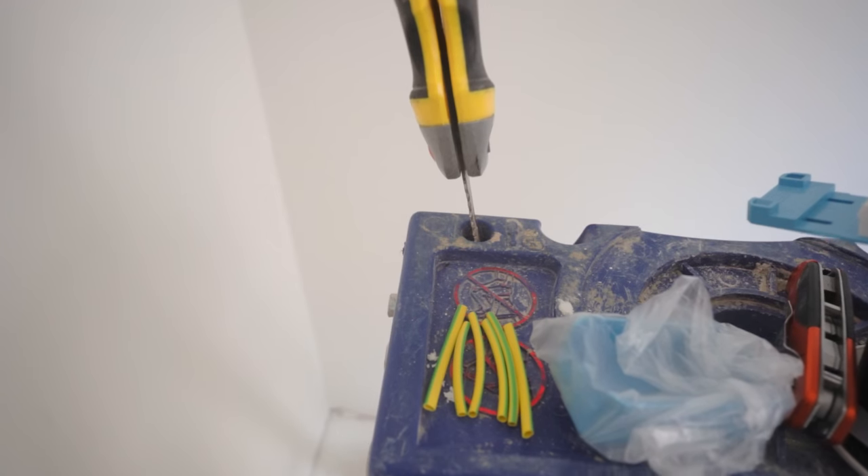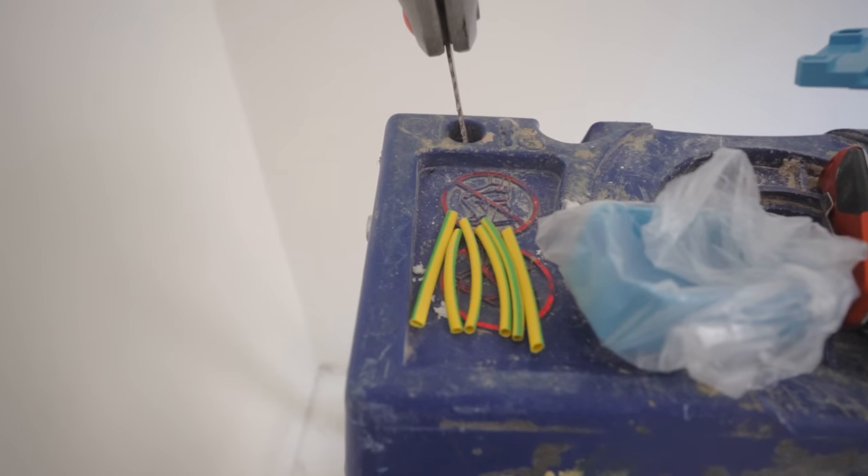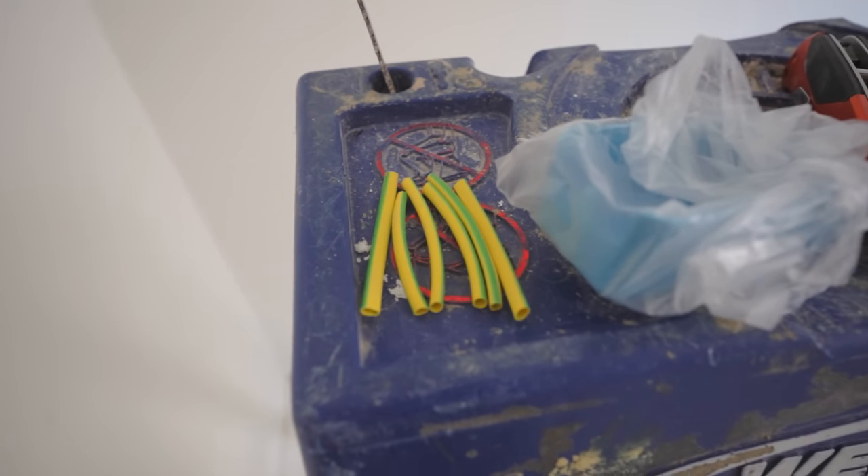You're not worrying about cutting sleeving on the go. You can also use the sleeving to determine how much to trim the cables back — you've measured it perfectly, slide it on, trim all the cables at that length, and it's the perfect second fix length. It saves cutting sleeving every time in two different sizes, and it also determines the perfect length to make off accessories.